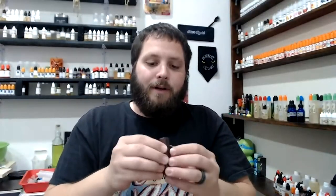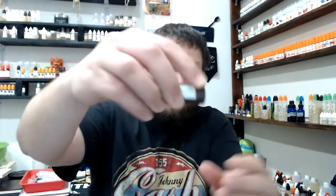You should also buy the insulator — that white part right there. It protects the positive so, if you don't know how these batteries work, that metal right there is the positive part of the battery. The whole rest of it is the negative. That's why it's really important to keep good battery wraps on, because whatever is exposed besides the positive part is the negative part of the battery. It's extremely easy to get a short if part of your battery is exposed, so whenever in doubt just rewrap. You can also buy insulators — they're cheap, just buy some and replace those as well.